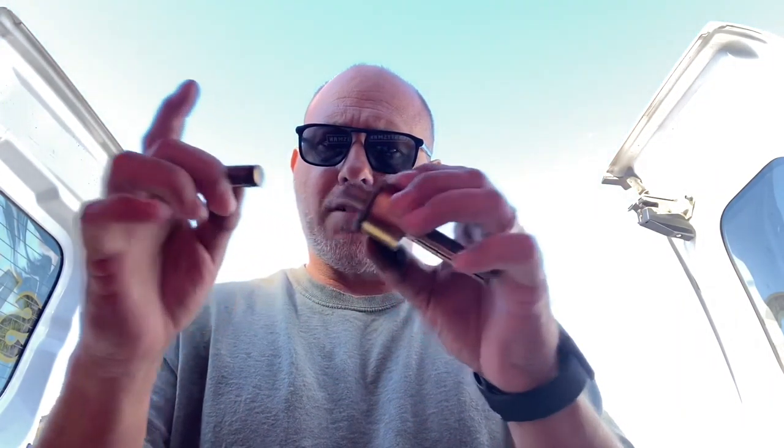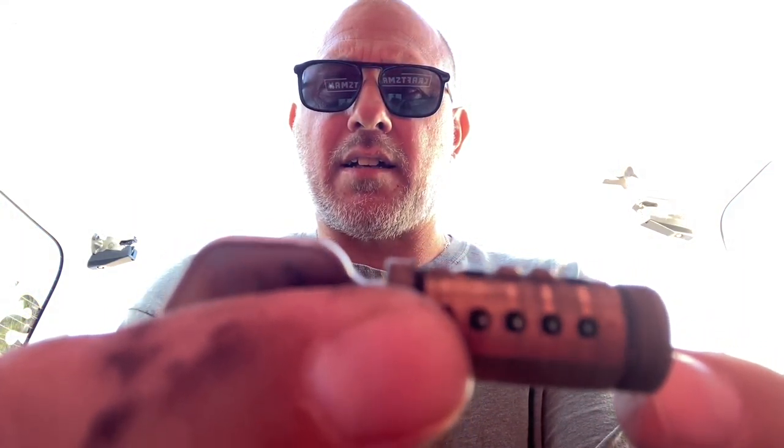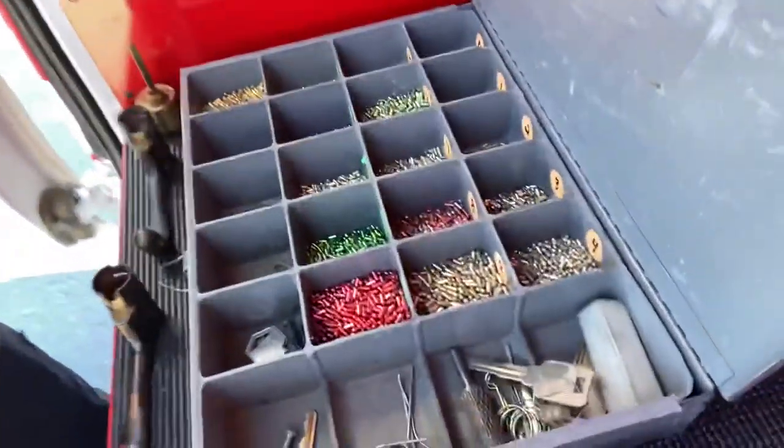The process of doing that is obviously take the lock off the door. You have to have the key to take it apart — I mean you really don't have to, but it makes it easier for us. We take it completely apart and, as you can see here, there are pins in there. What we do is we take another key, and the shear line is not nice and smooth, so that's a different key. To match it up, we throw those pins away and go ahead and use these pins.